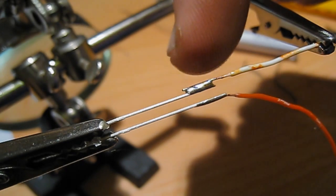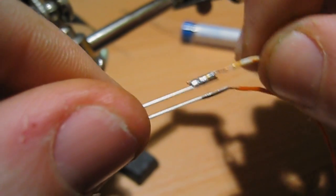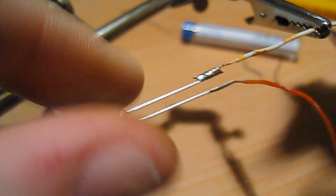See what I mean when I said this makes it so much easier, because you haven't got to worry about holding it in place. The trouble is, the leaded solder I just took off that switch is really filthy. Hold the heat on, apply a bit of solder, and pull away like that. Now that looks a little bit mangy there, but that's okay — as long as that's a good strong joint, that's fine.